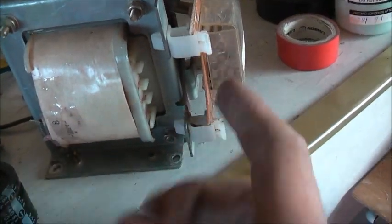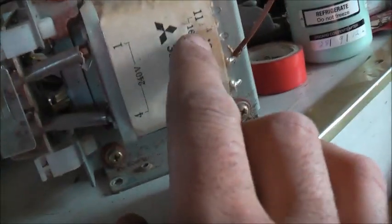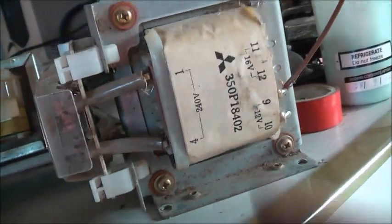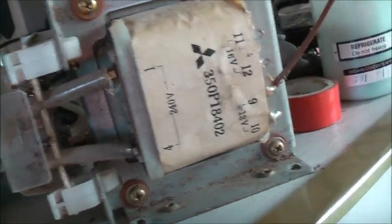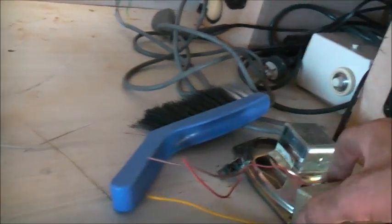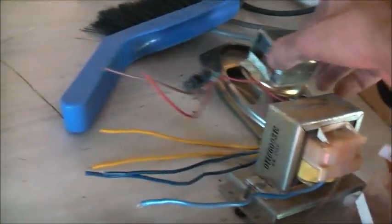Managed to repair this a bit, so I'm going to remove that circuit board. The fuses would have been useful, but unfortunately the board's broken, so I can reuse that, and yeah, I can get a good 18 volts off that unloaded. Rectified, unloaded, I get 18 volts, so that can run my Pi amp really nicely without distortion. So keep that for a car radio power supply. Very nice, and lots of goodies.